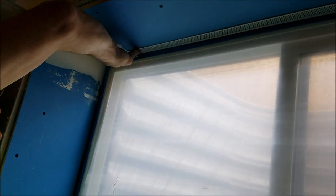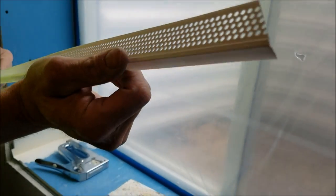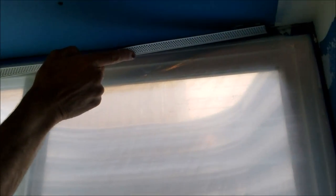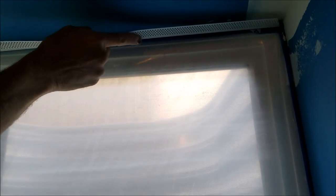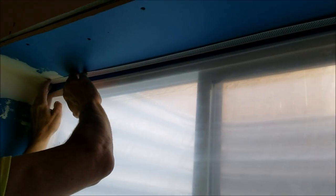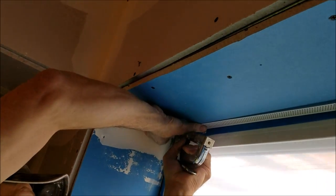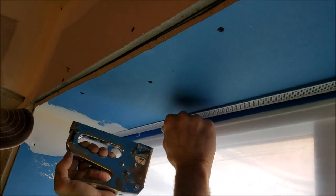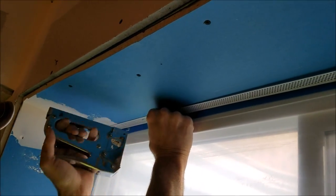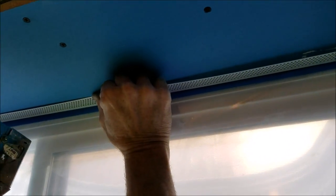I like to put this zip tear-away — kind of an L-shaped metal piece with tape. I always like using plastic bullnose because it bounces back; it doesn't stay bent. If somebody bumps it, it'll pop back into place, so you don't need to fill the back of it. I just staple it up and tie it against that tape up against the window.